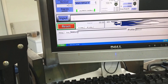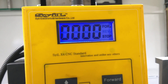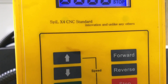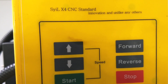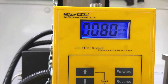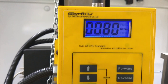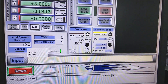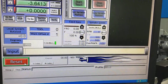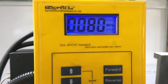Let's do that again. Right now I'm showing forward. If I go M04 speed 555 — there. It switches to reverse. I get 0, 0, 8, 0. The spindle wants to be moving at 555, but it's not. And again, this will error out if I let it continue in this state.